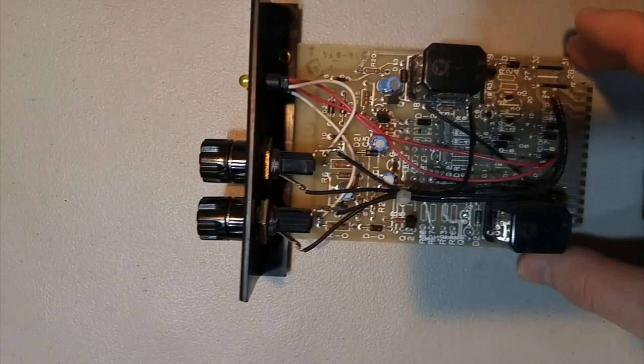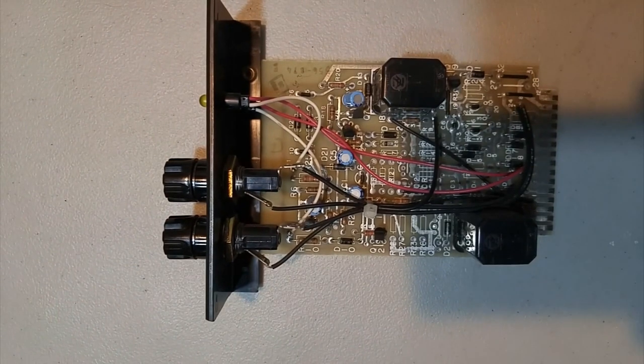So now, for the signal circuit card. The signal circuit card in itself is relatively simple. There's a circuit inside which measures the voltage, which puts voltage onto the circuit. 24 volts gets put out onto the circuit, but the polarity is backwards, so that the alarms, which are diode polarized, won't sound. Now, if it detects a short, or an open from a missing resistor, or a ground fault or something, it'll put power onto the trouble circuit inside the panel and put the panel in trouble.